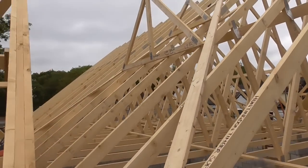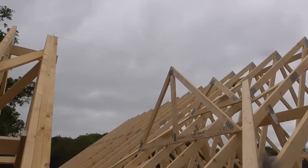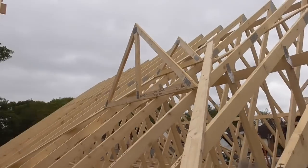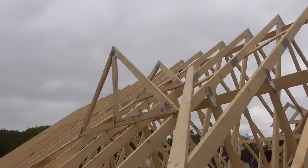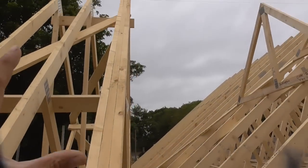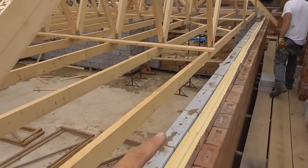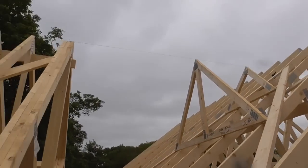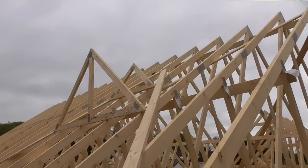In this instance, it's fairly common that the truss manufacturers will send out diminishing trusses. I don't like them because I've always struggled to put them in — I normally put straight edges across the top or lines at the bottom. What we've basically got to do is line up three points: the ridge point — and if you can just see there, I've put a line through — this ridge will run all the way through to the other end. I've pulled the string line all the way through.